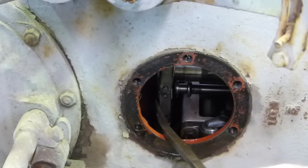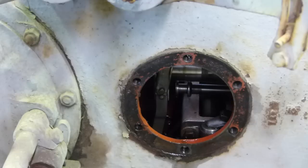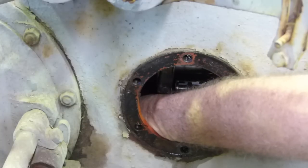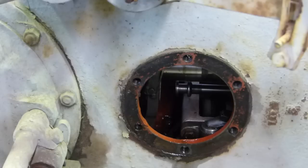Inside you can see part of the fork that goes back and forth. What you need to do is pull one arm one way and one the other - look or feel inside and you can feel that the hydraulic control valve has come out of those two forks. The next thing is to move this to the rear, which gives clear access for the control valve to come out. We're going to pull the top cover off first so I can film down onto the control valve to show you what happens.